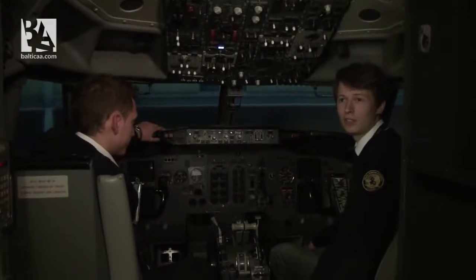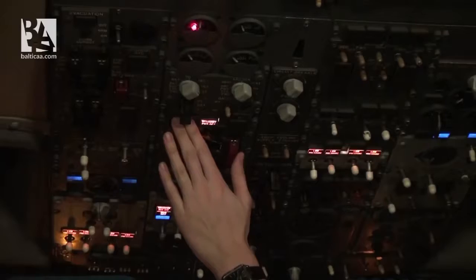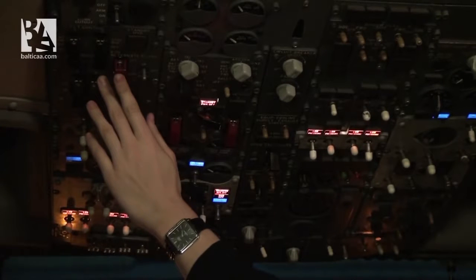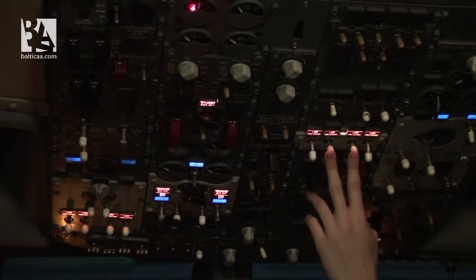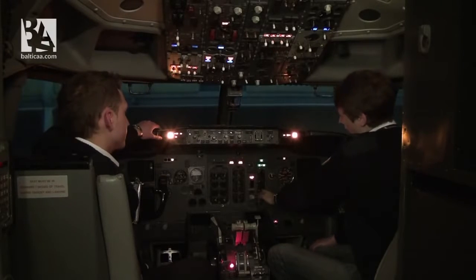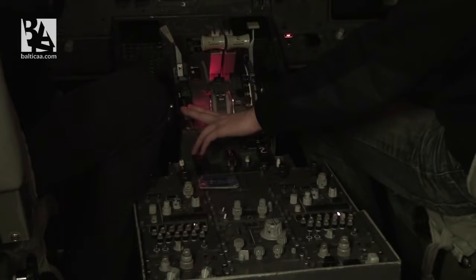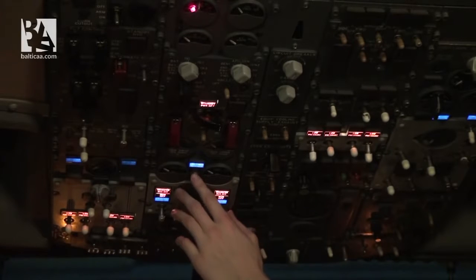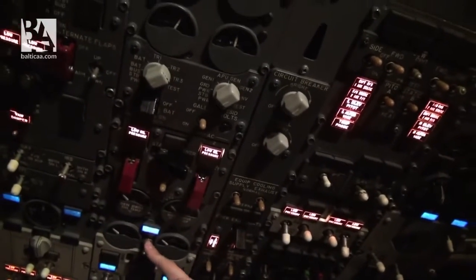I would like some lights, so to do that I'll check eight items. First of all, battery on. We check that the standby power switch is guarded, the alternate flaps guarded, windshield wiper is off, electric hydraulic pumps off, landing gear down and three greens, weather radar is off, and parking brake is set. We can see ground power is available, so we set that to on.